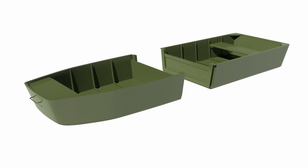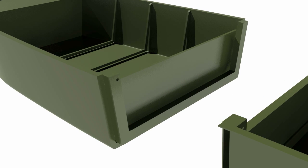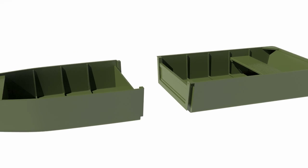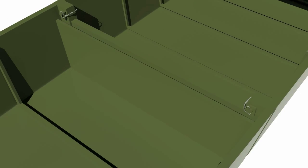The invention consists of two separate boat sections that are joined together at the halfway point. Each section is provided with a bulkhead that forms a completely water-tight hull. The two bulkheads are then placed right next to one another and joined together at the bottom by use of a locking flange, and then at the top by use of two strong locking pins.